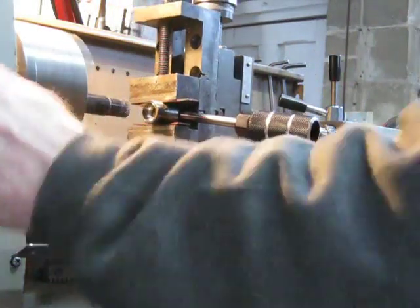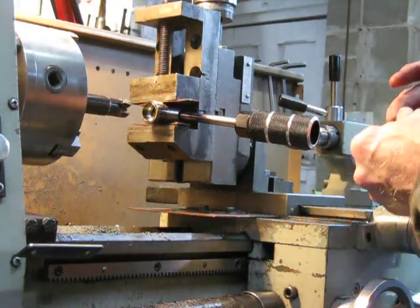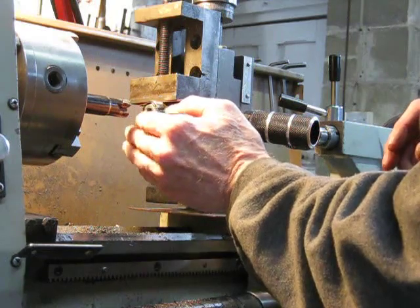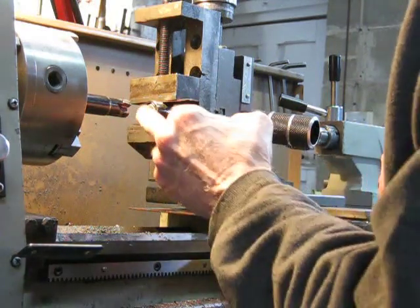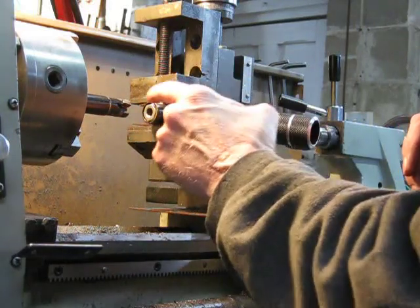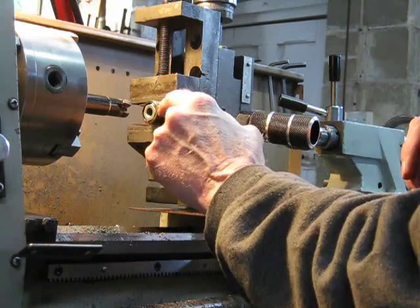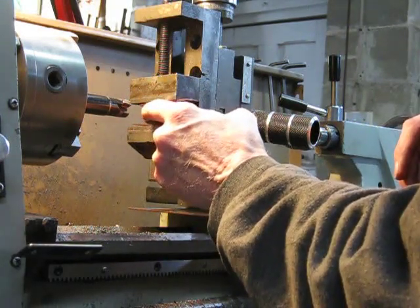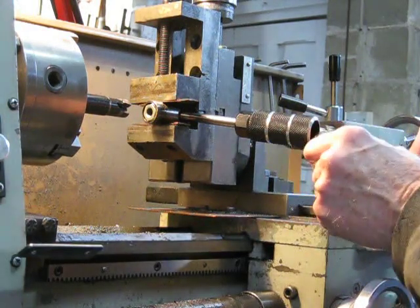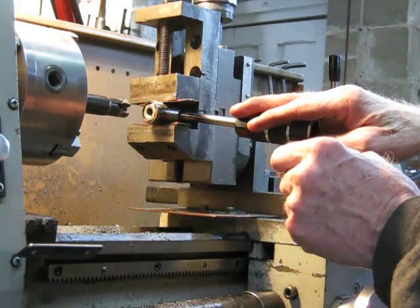As you can see, it makes it dead easy to do your boring — that'll be a perfect job. Excellent. So that's exactly how I want to do it. What I'll do now is I'll take that out and I'll braze between the flats and the circumference of the hole I've drilled, then face it off and bingo — instant usable tool post wrench.